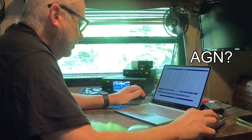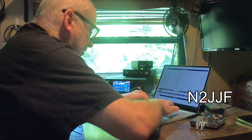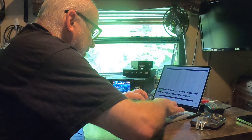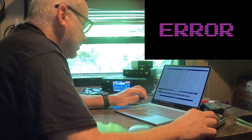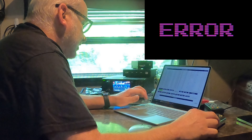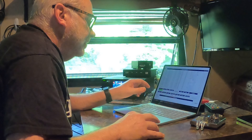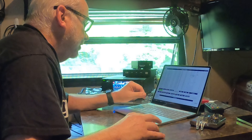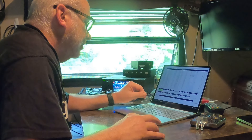It got stuck at 80 meters because a dog chewed my power cord going to it, so I can't move the plunger up and down inside the antenna. It's stuck on 80 meters. The tuner will tune it on 20 and a lot of bands, but it's completely worthless — it's basically a dummy load and just doesn't get out. It's a good educational reminder: if an antenna is too far off resonance, even if the tuner tunes it, you're not going to get out well.